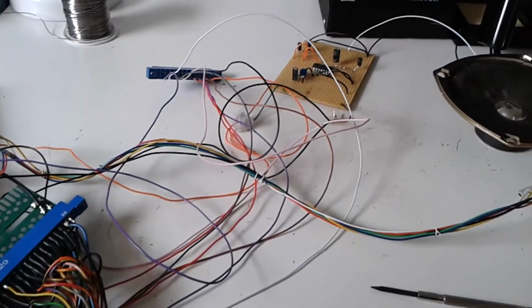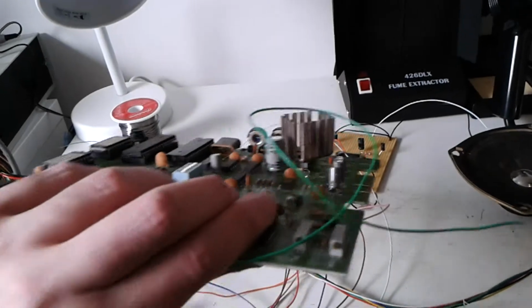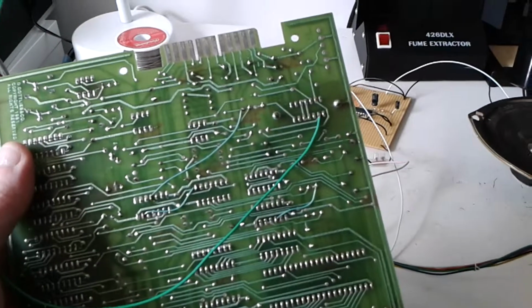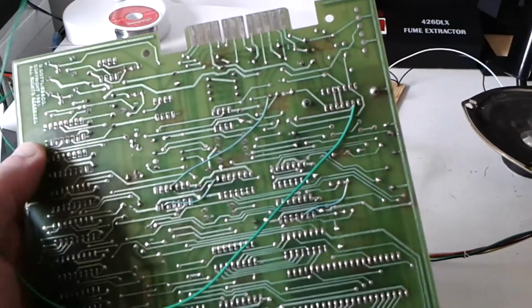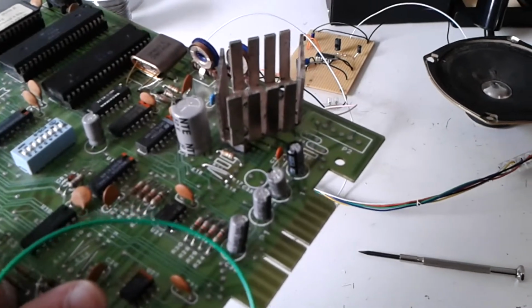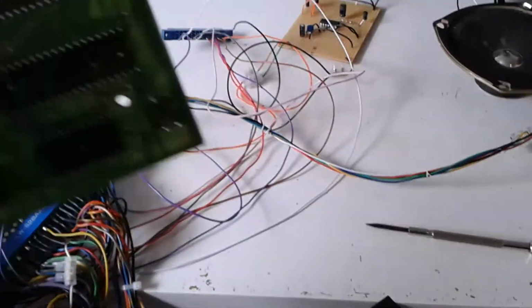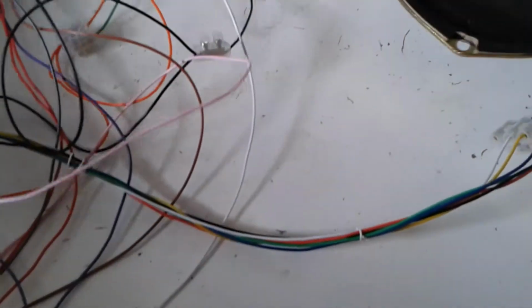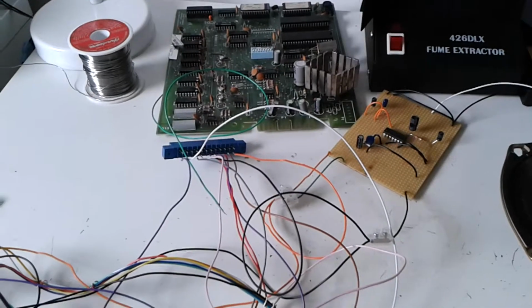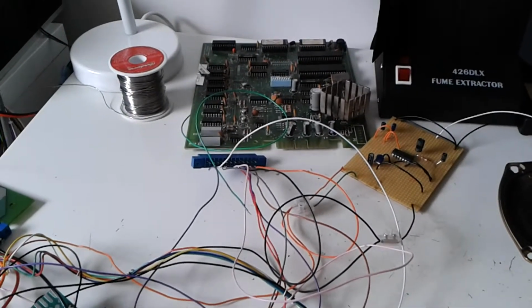I've double checked all my wiring. Looks absolutely fine. So what I've decided to do, I got this other soundboard a few weeks ago, a spare one, and I've connected another wire to the U23 pin 9, but I also noticed quite a few issues on this board. There was a lot of dry solder joints, and also there was a blown capacitor. So I've just replaced the capacitor now, and also I've reflowed the board. So I'm going to give this board a go and just see if I get exactly the same problem with this board. If I get the same problem, I would assume then that there is something wrong with my wiring, although I have checked it and I can't find anything wrong whatsoever. It all seems to be wired up spot on. So let's just hook this up to the edge connector and up to the amplifier and give it a go.